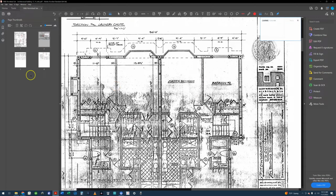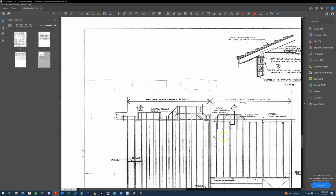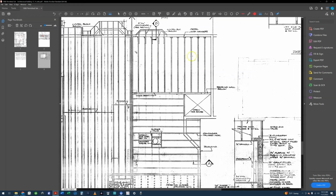So normally when they frame out the floor, they would double any floor joists that are underneath a partition that runs parallel to that particular floor joist. So there should be a double joist underneath that wall right here. And here you can see here's that wood beam that's going left to right. It ends on that concrete block partition, and it says here it's a bearing wall. So the living room, this is the opening for your staircase, framed for the staircase. So these are the floor joists running left to right.